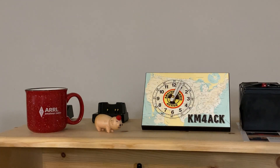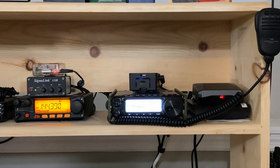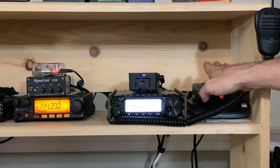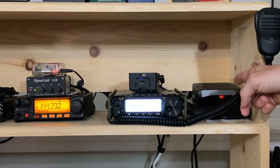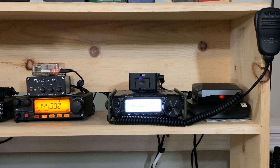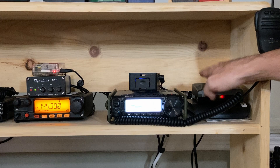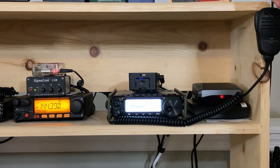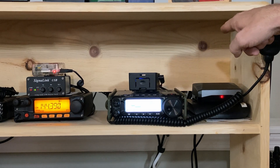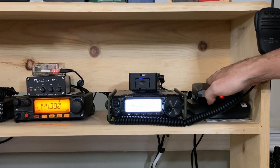Let's go ahead and take a look at the radios, starting from right to left. You've got the new Raspberry Pi that I just finished building on the channel — that's going to sit right here. Every other Raspberry Pi in the shack connects to this Raspberry Pi's hotspot. It's sending out its hotspot and also connected to a mesh node that's mounted behind this shelving unit to give it Cat5 access to the internet.